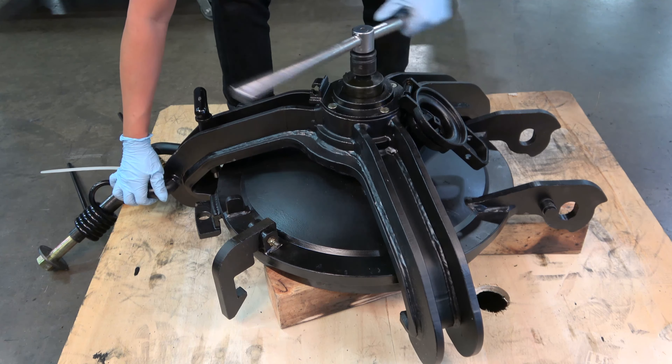Once you have reached the bottom for the second time, release the ram with one full clockwise rotation. Next, rotate the strongback into its locked and ready position. Release the T-handle and rotate the strongback counterclockwise so that it is aligned with the flange on the cover. With the T-handle released, the pin should fall into place in the hole on the cover flange, preventing the strongback from rotation. The lift assist spring can be adjusted so that the arms are laying back on the cover.